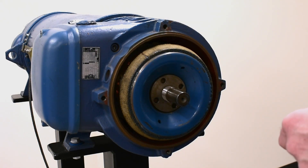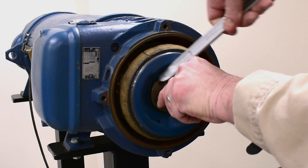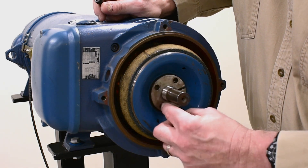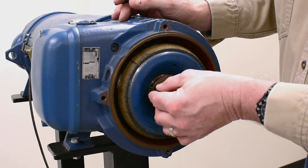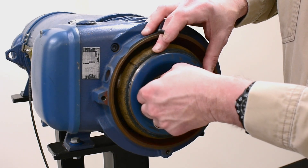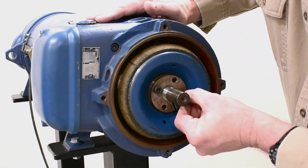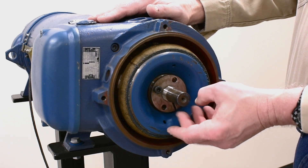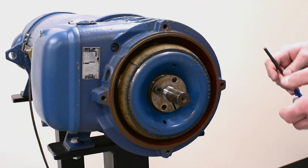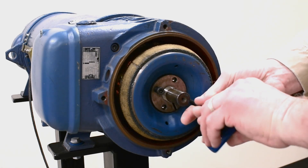We'll break this loose in the slot using our pry bar. After making the four-hole adjustment, use two of the screws to pull the assembly back together to the new position to compensate for the wear. I'm only going to use two of the bolts with no load to make the adjustment, and when I'm finally adjusted I'll put all four in. We'll cinch these down and you'll see how the disc moves outward on the end of the motor shaft to make up for the wear of the rubber material.